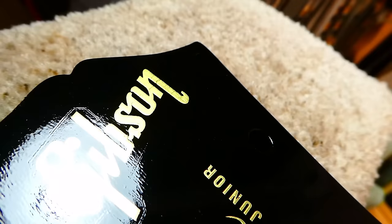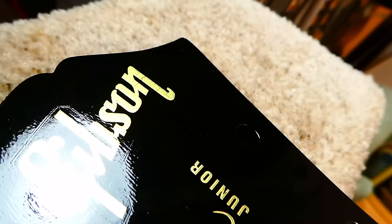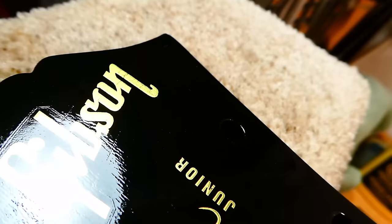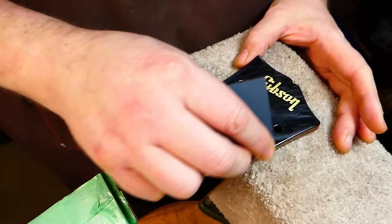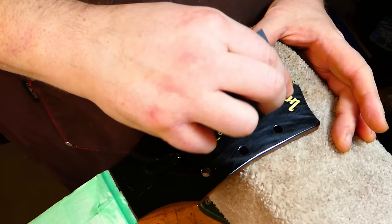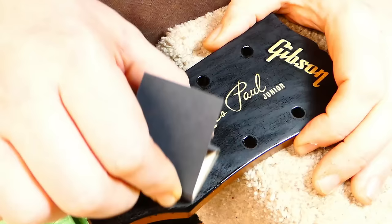Witness lines usually appear somewhere down the road. You can see that around the decals — these were gossamer thin. The day after I sprayed, this looked perfectly flat; now they're thrown into relief. So I'm going to sand the finish sitting on top of them down to the level of the surrounding stuff. Yes, that's very nerve-wracking. Next year, you'll probably see a faint line around them again, just like in the vintage examples. I'm block sanding with 1200 grit, doing it dry.